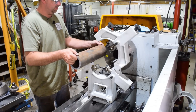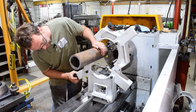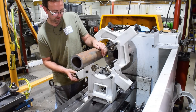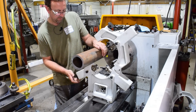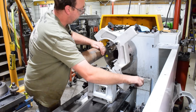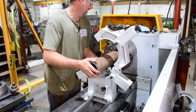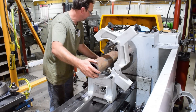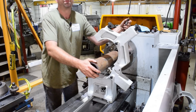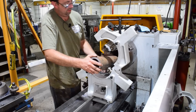So here's the material the customer brought me. It's just DOM tubing, and the reason I say this is probably not the best choice for this is because it's fairly soft. From my experience with bushings, you want something that's fairly hard. We'll make it because that's what the customer wants, and he bought it himself. So when it doesn't work out, that's not on me, luckily.